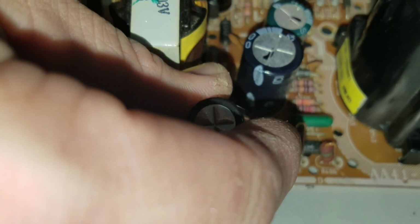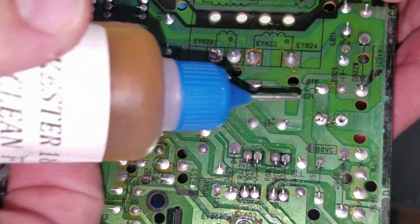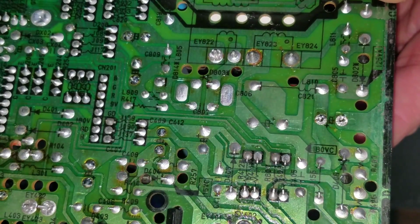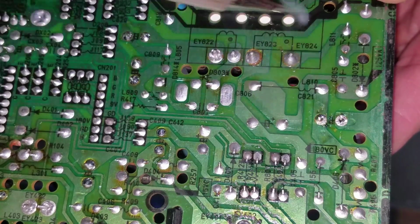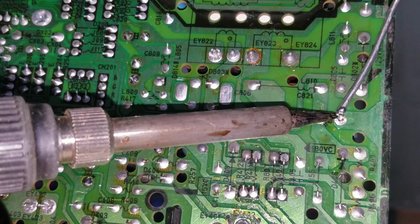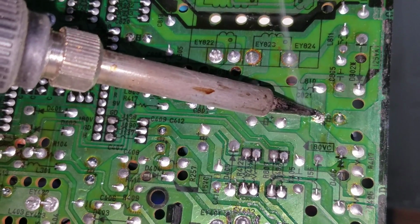Go ahead and stick this replacement one in there. Make sure you line up the negative and positives with the right sides. And then put some solder on it. Here's my spot. Let's put some flux on there. Wiggle it around a little bit. And after you get one set, it's easier to come in and set the second. You gotta put some more on that one.